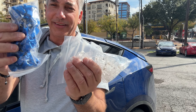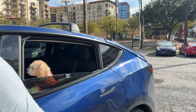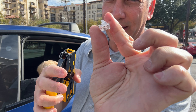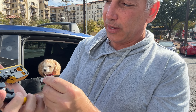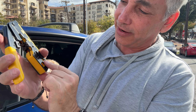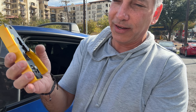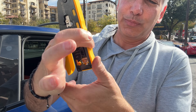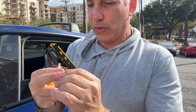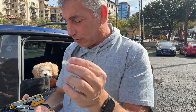It comes with all the little ends and then the little insulators for it. So I'll just take one of these out and show you how it functions. You'll line up all your wires in there in the correct color, and the wires will go pretty much all the way into it and through the other side. Then you stick your connector in the crimper here — the wires will be coming out the back end and they'll be lined up. When you push this in, it's going to crimp it and put everything in there, and you'll have your end on it. You can see that part pushed down, so everything squished into it — it pushed down the plastic to crimp it.